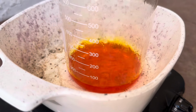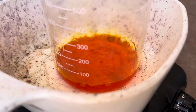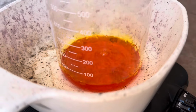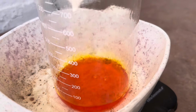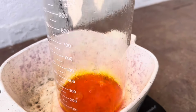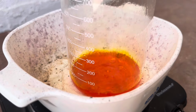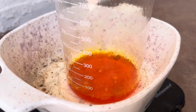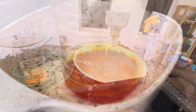And we're ready to go. I've boiled off any excess nitric. There was a little bit extra when I topped it off. And as you can see, it's reduced in volume and there are no fumes being produced. So we will cool this off, filter it, and then drop the gold out again using SMB, and we will be left with our gold.